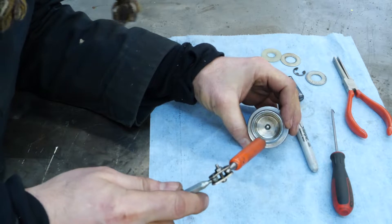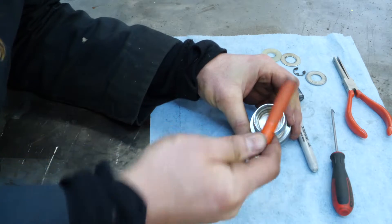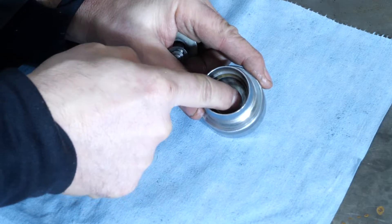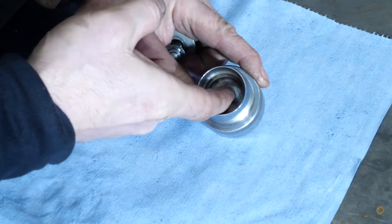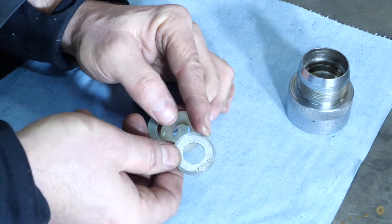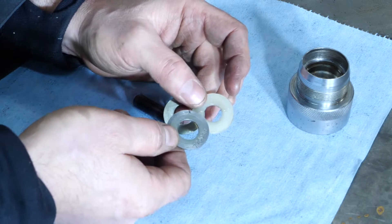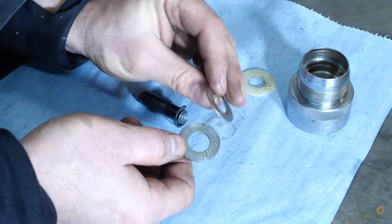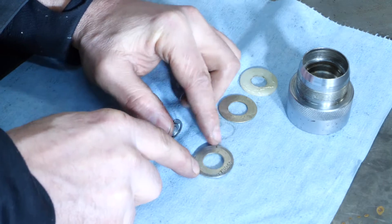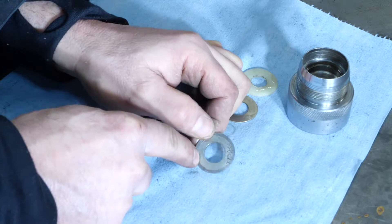I've learned you need a magnet to extract that ball from there. So here's the situation: inside there is a ball bearing ball which I suspect is a quarter-inch imperial size. This thing has three washers, and there's also considerable oil here — I think it's from oil splash from the damping oil of the balancer. There's a thicker washer — that's the one the thing was pinched against, and I can see I slightly scratched it with my boring bar.